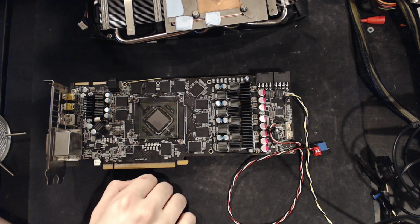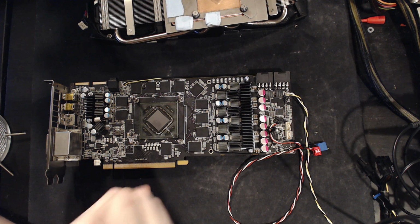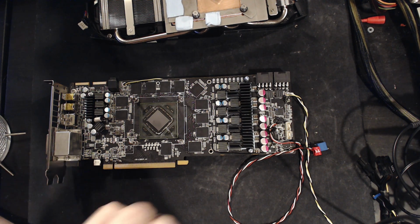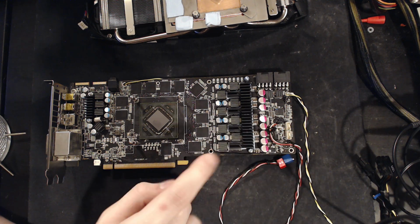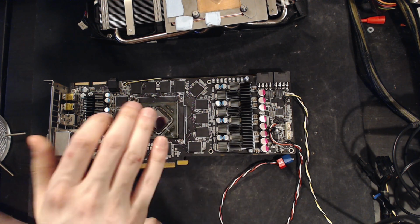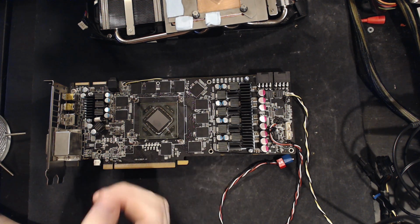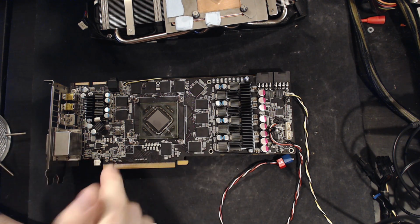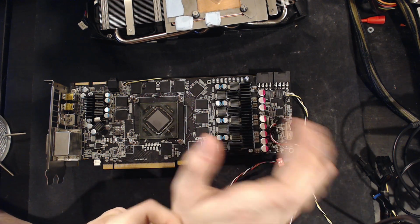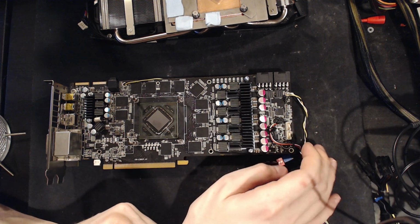But, well, I mean, in the past, I've also just cut the voltage sense trace. So, you know, it's not really a departure from my worst. This is actually better, because you can actually replace resistors. You can't fix a cut trace. Well, you can fix it, but you can't mask that you've done it. You can't do it cleanly, because there's a great big hole in the PCB. Well, it's not huge, but you end up digging out a tiny little trace. It leaves a bit of a mark. Whereas this, as long as I buy some 0 ohm resistors of the right package size, bam, it's solved. It looks like new.